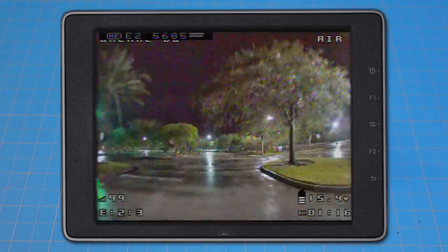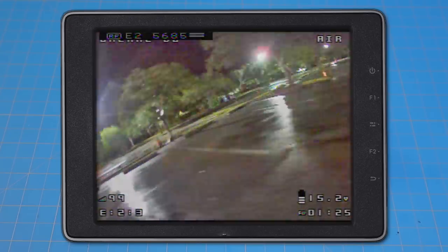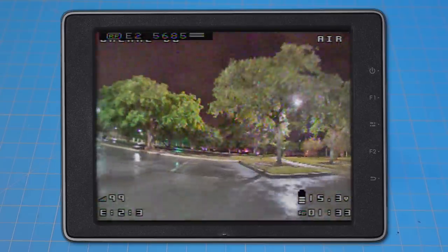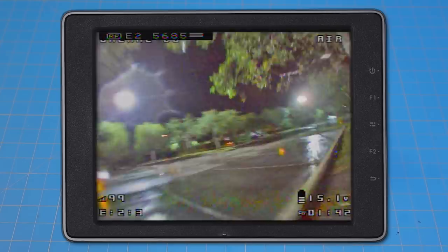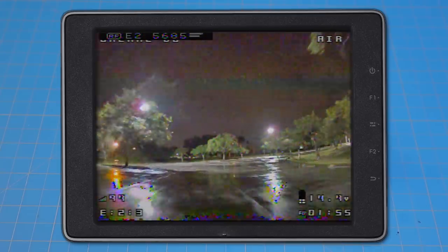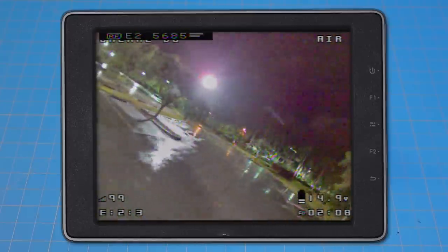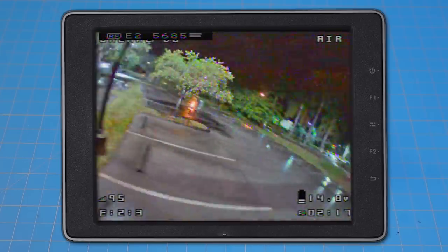At ranges of maybe around a hundred meters, breakup is minimized. And then as you get to the edge of reception — for instance, going out of line of sight around a building — at the point where you would really be out of range with the Furious module where you couldn't see enough at all to do anything and you'd have to punch out and gain altitude to reestablish line of sight, there's still a little bit of video with the Rapid Fire. It's almost like a black and white grainy outline fuzz, but you can still make things out. Whereas on the Furious or a traditional diversity module, you're basically not going to have anything. So it's able to hold on a little bit at the edge. I was flying about two to three hundred meters away, going behind a building and completely out of line of sight with the receiver, and there was still a little something you could work with.